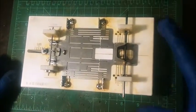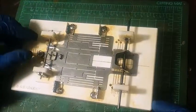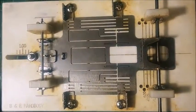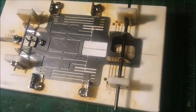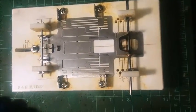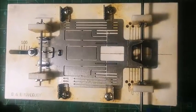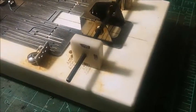Alright, so this is your basic jig block. What I'm going to do is use our jig wheels, which I'm going to try and set this up so that all of our heights are at .950 tire for .050 clearance in the back, .950 tire .032 clearance up front. These jig blocks, you'll see on them, I'll try to show you a little bit later, that there are 4 different dimensions on them. There's .950, 1 inch, .890, and .975, which are common hard body sizes.